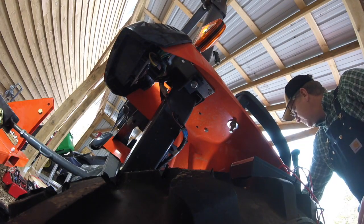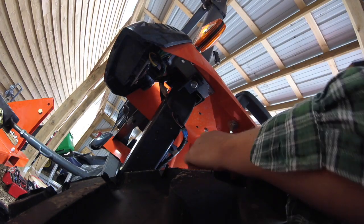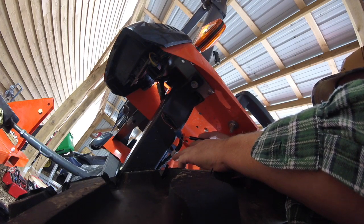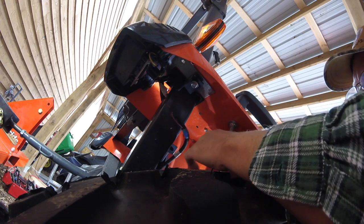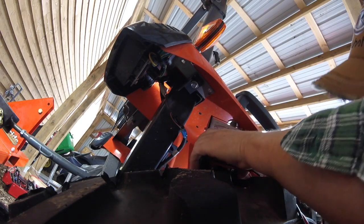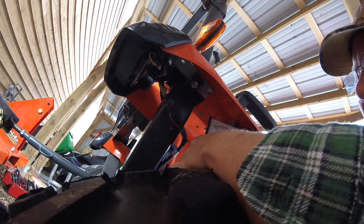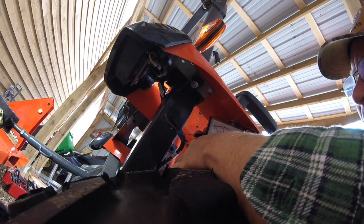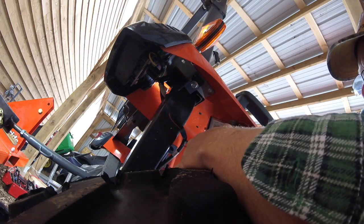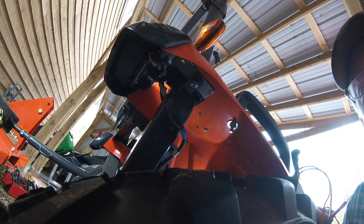Let me just throw on the accessories so I can throw a little power to it, and let's test it again. And yep, there we go. Got 12 volts on those leads. Okay. So I don't know if you need to see it or not, but there's your multimeter. Get them under there. Okay, and we're going to throw a lead on there, and one on the negative. And there's your 12 volts coming up. Okay, so that's a good sign. So we've got power, we've got two leads. Let's take a look under the hood, and I'll show you the fuse panel.